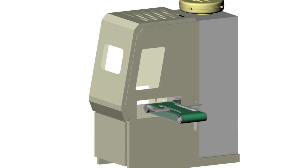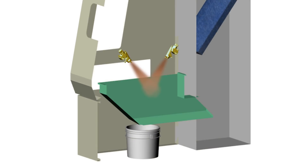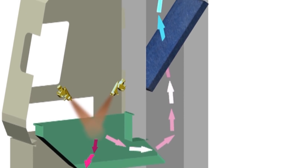The moulding sprayer concept is simple. The transport belt carries the workpiece underneath the spray guns that trigger on and off, applying the atomized coating. Underneath the spray guns are troughs which capture the overspray and recover a portion of the liquid medium. The remaining atomized spray is pulled through the filter box and exhausted out.